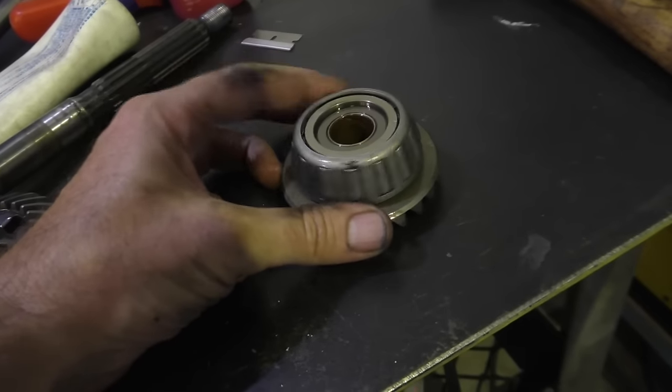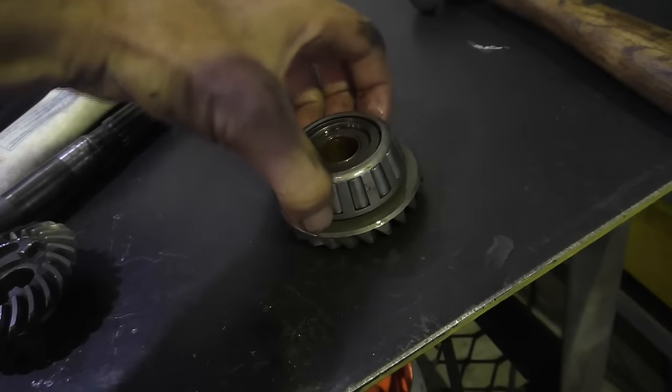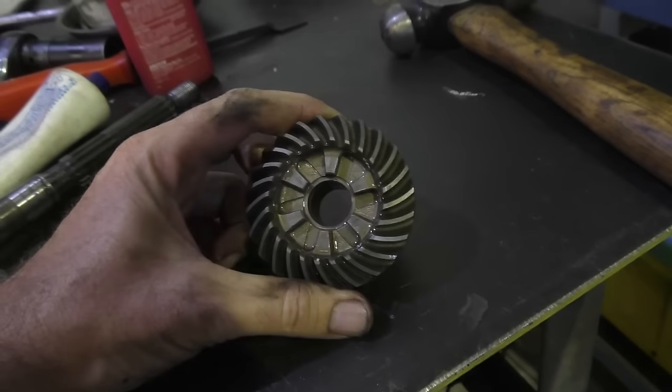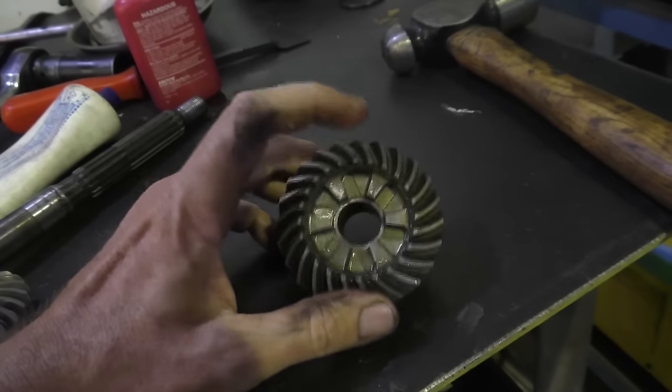So in order to replace this bearing, we need to pull that race out and also separate this and pull this using a press, pull the bearing off here. We might do that to replace the bearing itself, or we might do it because the teeth are damaged on this forward gear. Now, I'm not sure this video showed you how to do anything particularly useful, and I apologize for that,